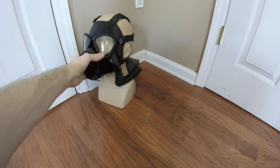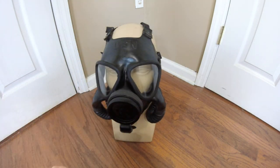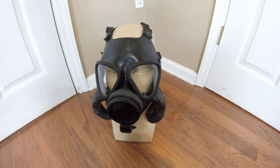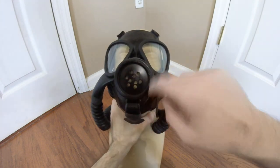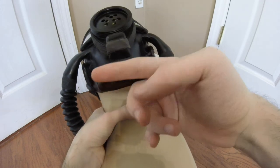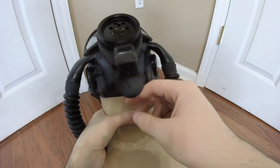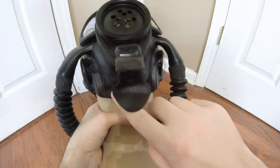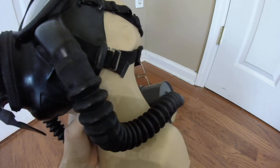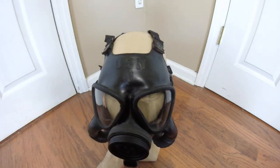Now on to the mask itself. Typical Navy Diaphragm Mark IV, with USN and universal size stamped on the front. You have the nice triangular eyepieces like those used on the M2, M3, and most American masks of the time, with cellulose acetate plastic eyepieces. You have the diaphragm angle tube assembly, which being mint unissued has lots of paint still intact with no chipping. The M5 spearhead valve is intact with no tears or ripping — all perfectly flexible. Markings on the chin read GRS, an MSA logo below that, then Mark IV, Lot 1, with the face piece produced in January 1945. Interestingly, the mask was packaged in 1944 but the face piece is dated 1945.